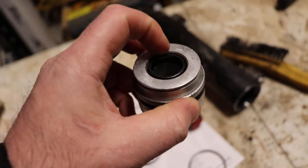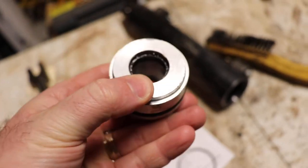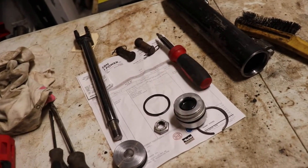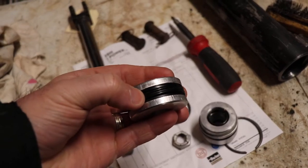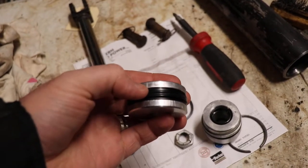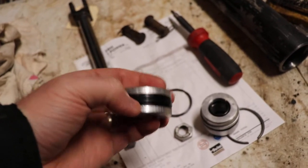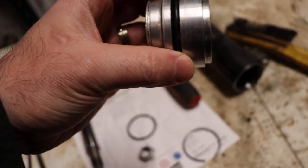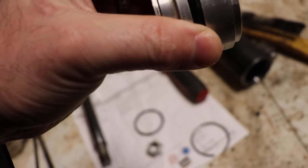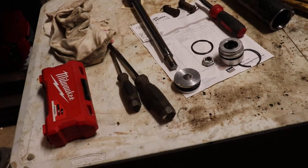There are really only a few parts in here. There's a wiper and a seal inside - it looks like they put some lubricant on it already. You can use oil or Parker o-ring lubricant. On the piston there's one seal and two rings. To rebuild this thing you need about five or six parts total, including another o-ring in the backer. For 50 bucks they measure it and give you the parts - pretty good.